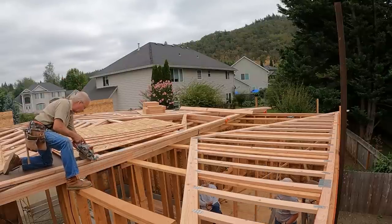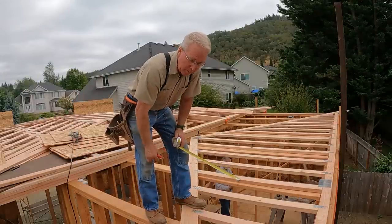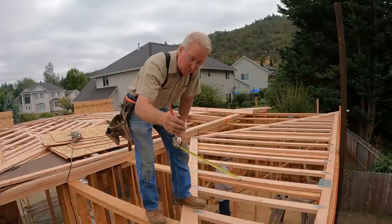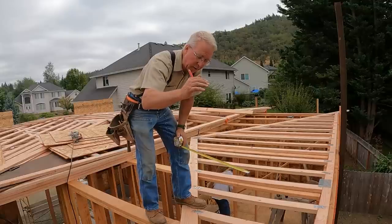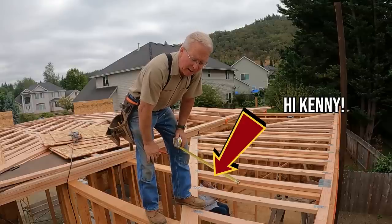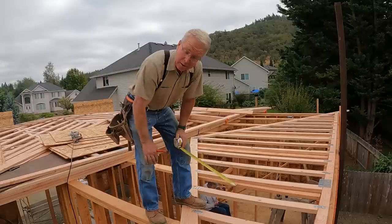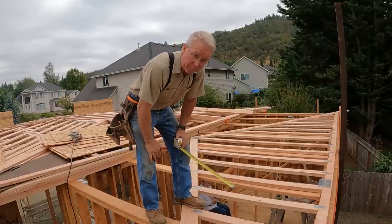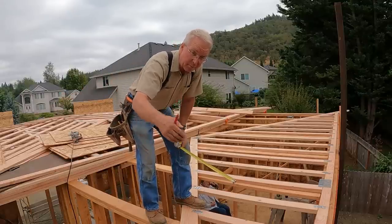Here I'm laying out the lookouts, or outlookers, they're known as both. They have to be located so that the break on the plywood installed at the overhangs, that AC face, A face, AC ply, plugged and sanded, really nice material that we have stacked up here on the scaffolding right now, these things have to receive the joints, the breaks between those sheets.